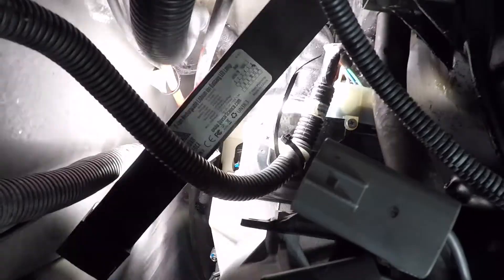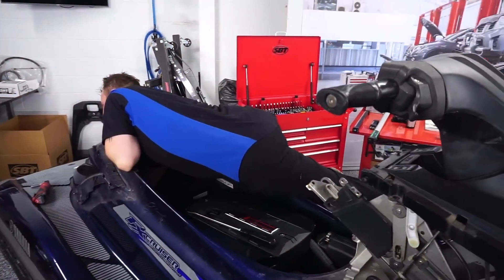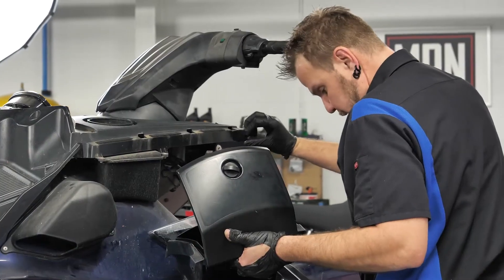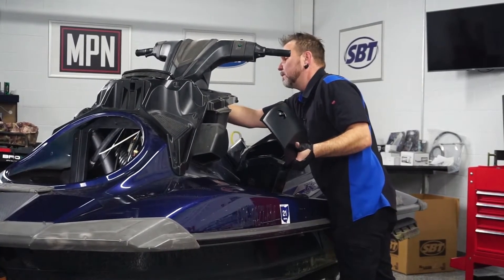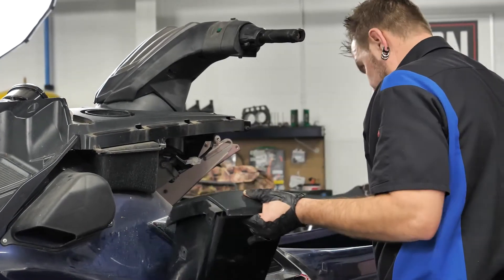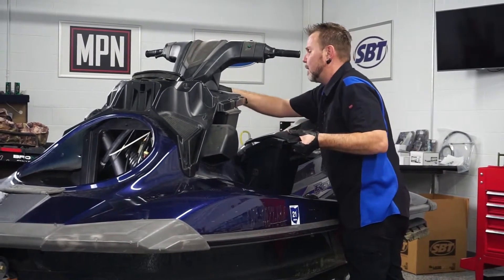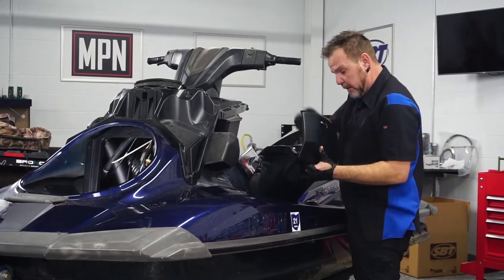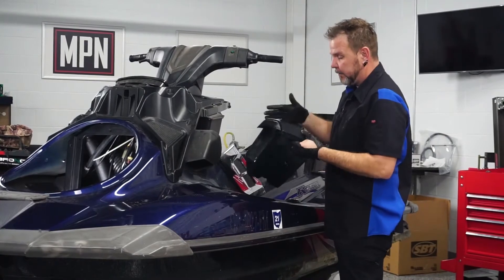Removing and tearing down the engine from any jet ski can be challenging — there's not a tech out there that won't spend more time looking for their tools than actually doing the work. This one came with its own set of challenges. The key to any mechanical project is organization. If you're not sure, everyone has a camera in their pocket these days — taking pictures of what you disassemble is a great way to remember where it goes. Also, put all the screws back in the positions where they were so you're not mixing them up when you put it back together. Taking your time is critical — not pulling too hard on plastic panels without looking for hidden screws is very common on a lot of these.